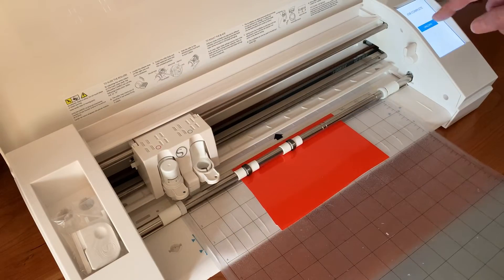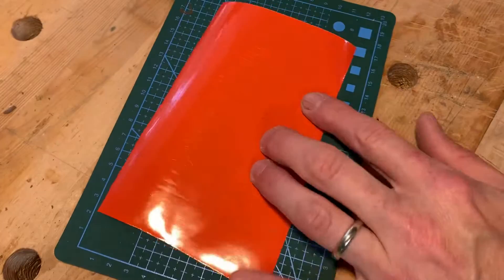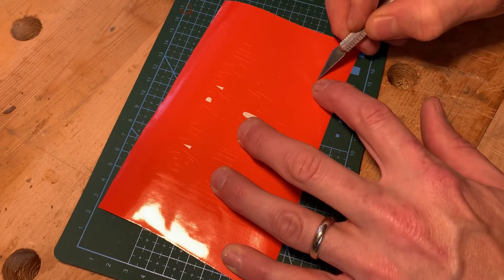In the past I've done this kind of thing with a laser engraver but I think the brass plate has a certain class. After the vinyl has been cut I weed off all the areas that will eventually be exposed to the acid during the etching process.